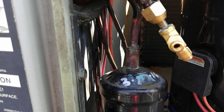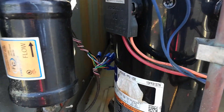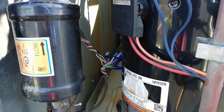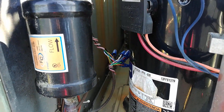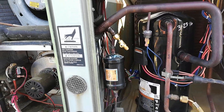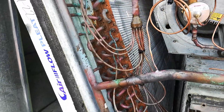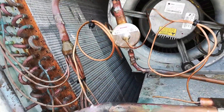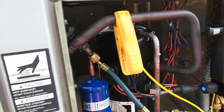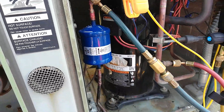Look at that — they've got all those wires back there just ready to be cooked. And look at this splice — that's terrible. But we'll make do. New TXV — got it all brazed in, looks okay. New dryer put in — it looks just factory as can be.